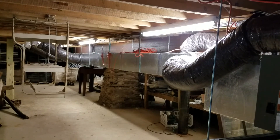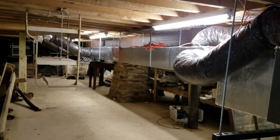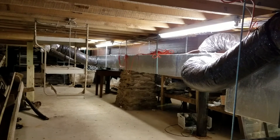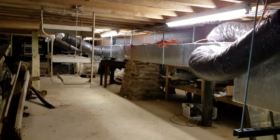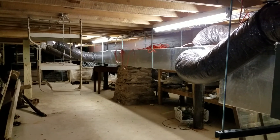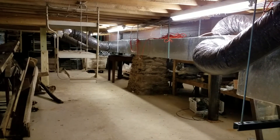Most of the rot comes from the fact that the windows were never left open down here in the basement, so there was no ventilation — no dehumidifiers or anything like we use today to keep things dry. It was always very damp down here, and there was not a concrete floor, it was all dirt. We also had flooding in here in the years previous, which made it pretty bad.